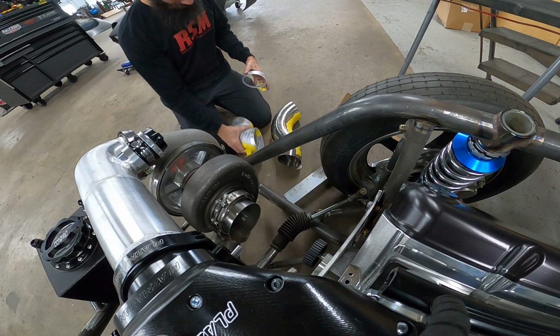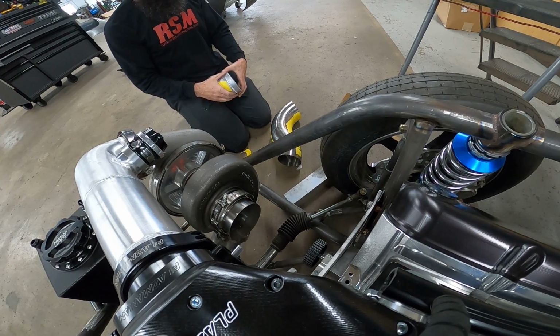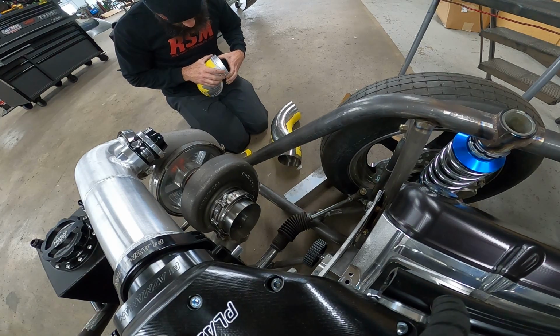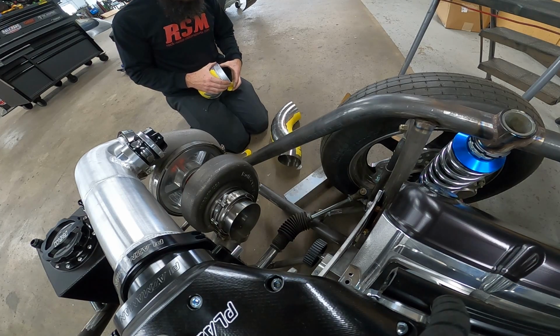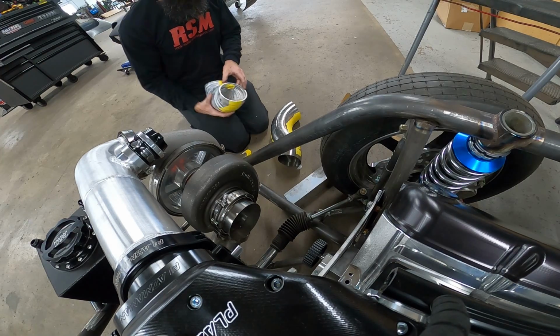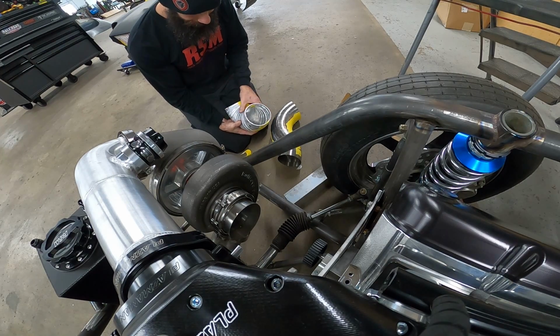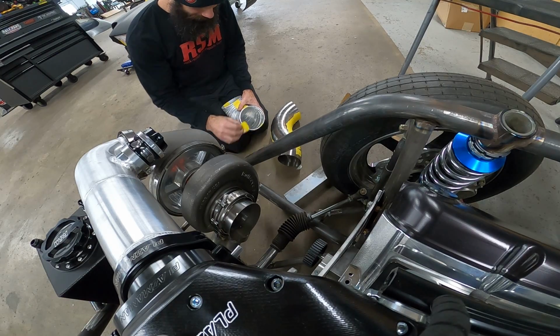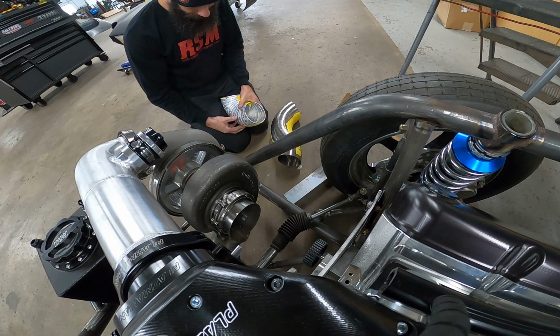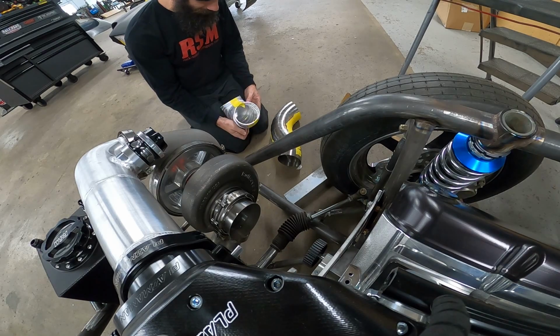I'm not sure if I want to try to cut these out of that titanium straight. Definitely going to have to put a fresh saw blade on there if we do, because the saw blade that we have back there is missing about 20 teeth off of it, and it was tedious enough trying to cut this aluminum. And the titanium will flex a lot more than aluminum because its material is so thin compared to this.